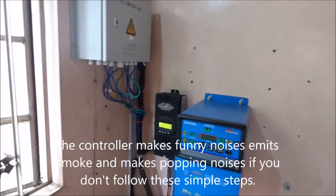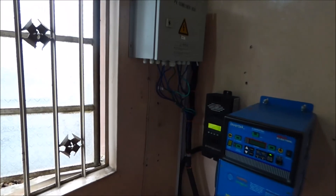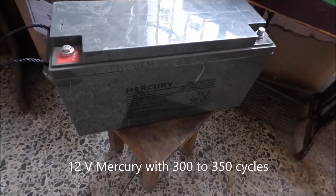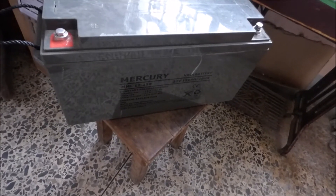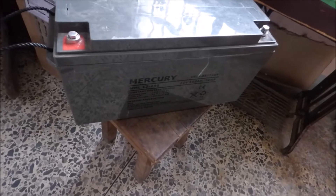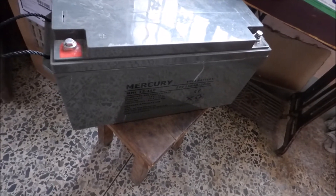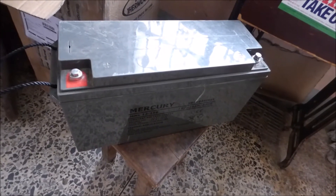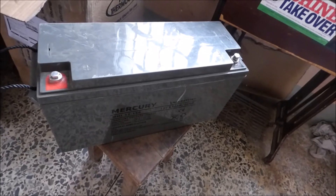Having said that, let's have a discussion about batteries, then I'll show you mine and how I arrange them inside the battery box, and I'll tell you the advantages of purchasing the type of batteries I purchase relative to what everybody else does. Right here is a 12-volt battery — 12-volt battery has six cells. This particular battery, Mercury, is very popular in Nigeria. The shelf life or design life of this is about two to three years, because they're designed for about 300 to 400 cycles. A cycle is a charge and discharge — do that every day and 300 cycles is about one year.